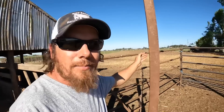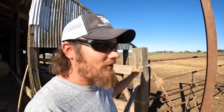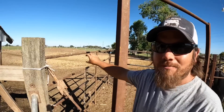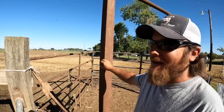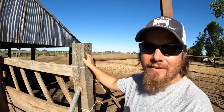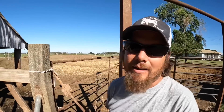Originally, I had thought about welding a piece of angle iron onto that post and then putting boards across this gap, but the more I look at it, the more I don't really like that idea. This wooden post is not straight, while this post is very straight, so the boards are not going to fit up very nice. Now I'm kind of leaning towards welding just stub shafts right off of this post to fill this gap in, and then in the event that I want to eventually rip this out and replace it, I could just weld onto those pipes.